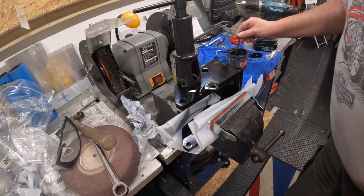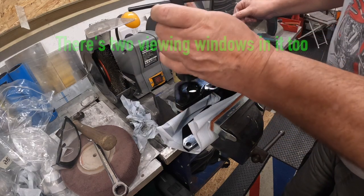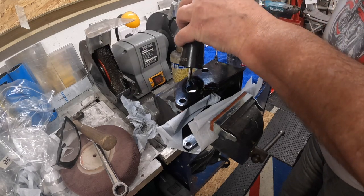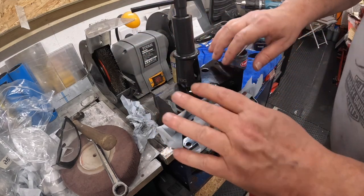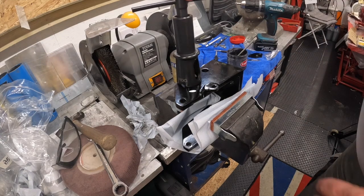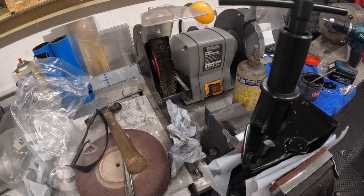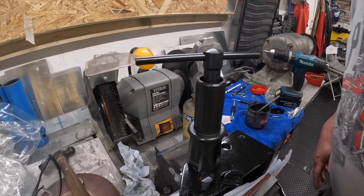So yeah, we'll just give it a bit of lubrication, as you always do. Right. Nice bit of lubrication. Drop the tap over the hole. Drop that guide down so it's flat on the surface. And this now, if you don't rock it about too much, should be 90 degrees in and straight. Shouldn't it? Well, let's have a look. Let's find out.